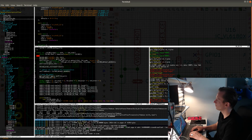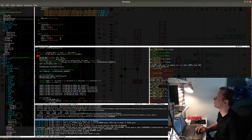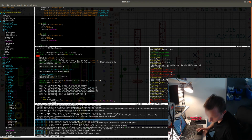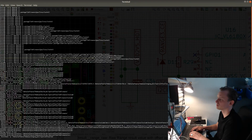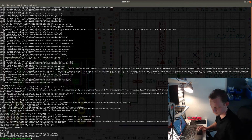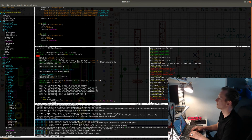Okay, so now instead I have to check all the diodes, because it could very well be the case. Let's see. So if now the pins are set to open drain, they should still though be set to zeros. Interesting. Let's revert to push-pull and see if this works better. Chances are it's going to be the same result. I'm pretty sure it's going to be the same result, but I could be wrong. And that's okay. I'm going to continue trying different methods until I get it all right.